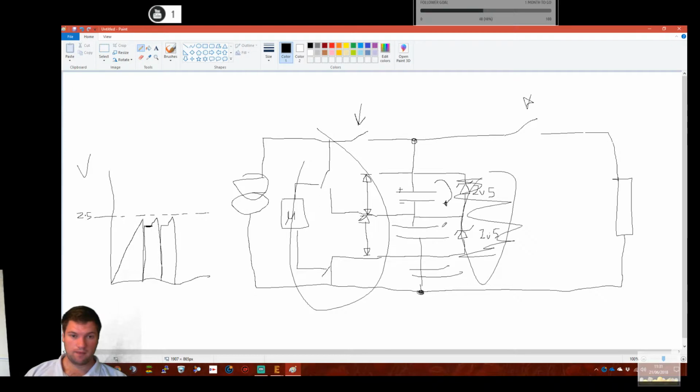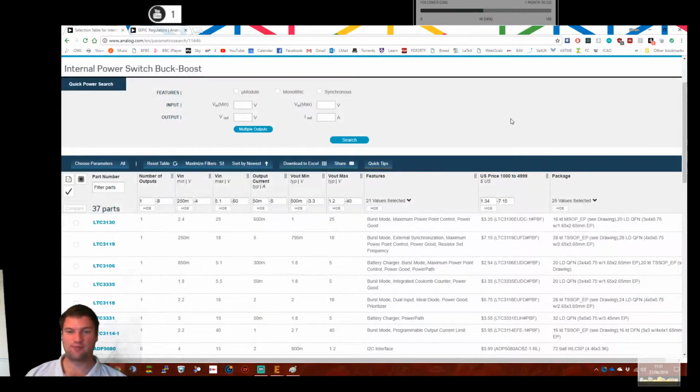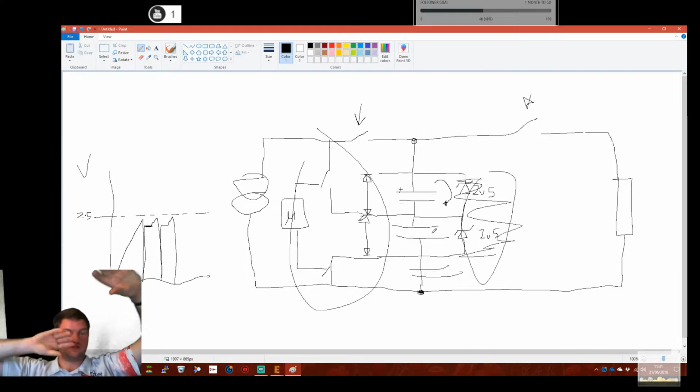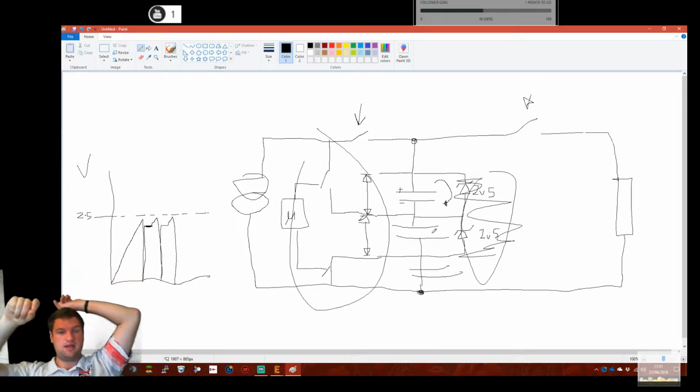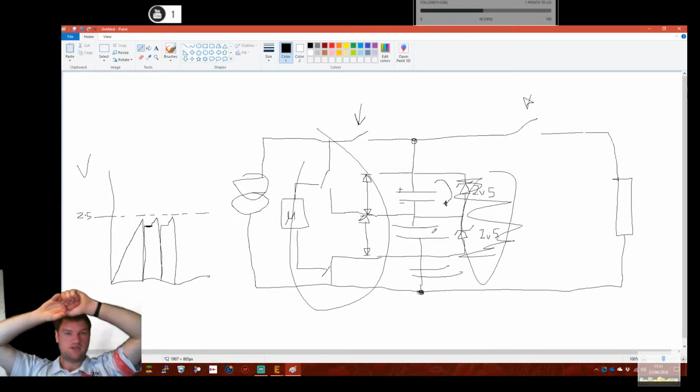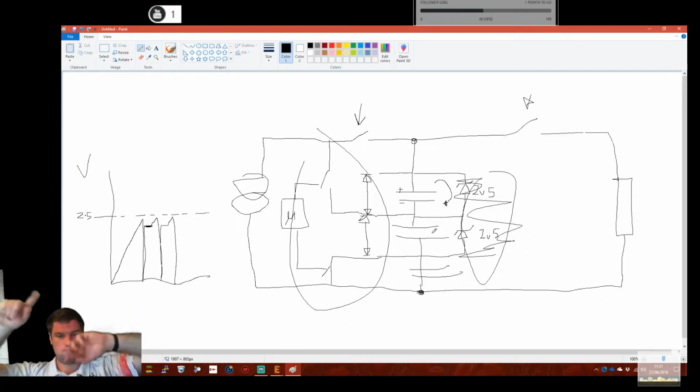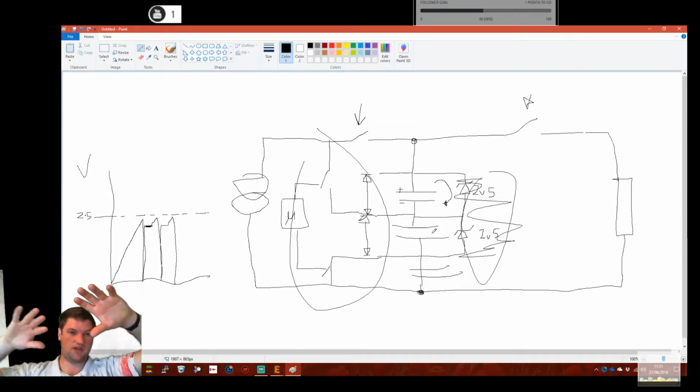The other way, and the even more crude way, is to just not care and risk it. Sounds fun, doesn't it? That's probably what we will end up doing, and I'll explain why. Simply because we're going to be plugging these supercaps into a terminal block. These aren't going to be soldered onto the board, because we're going to be testing lots of different devices. That gives me the ability to plug in an external balancer, a separate balancing module, which ensures that the caps are balanced, but it does that on a separate circuit that just happens, we cram the wires into the same terminal block.